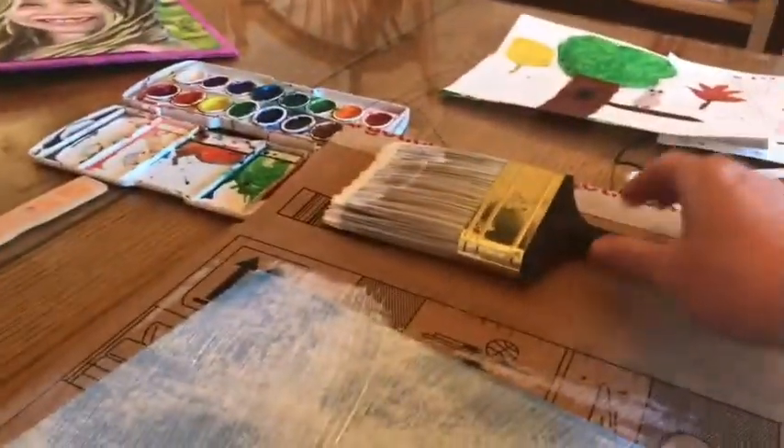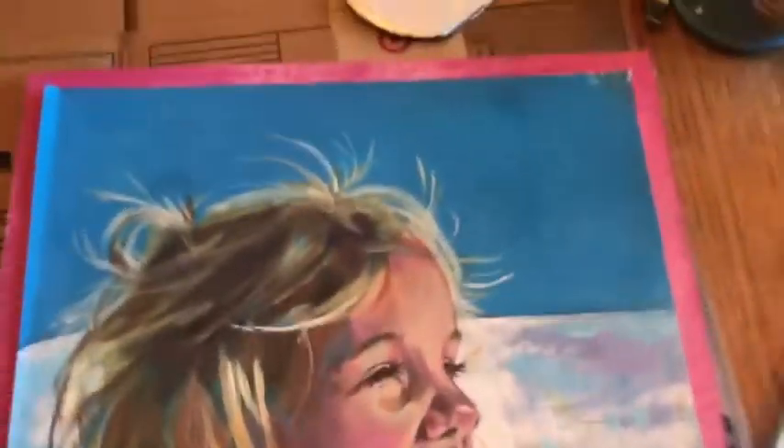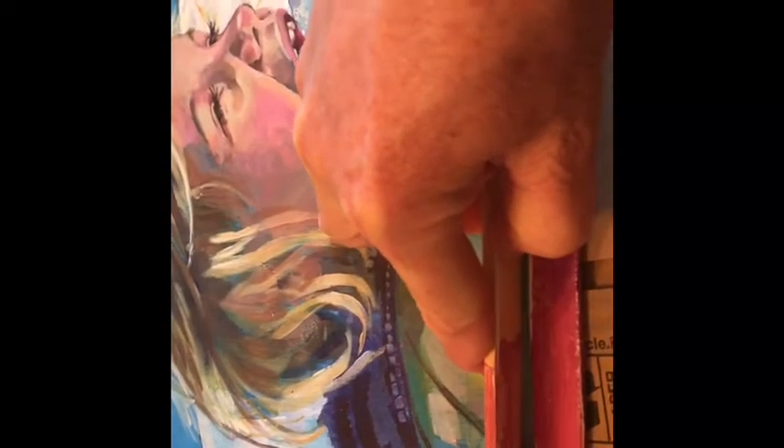This gel will dry and destroy your brushes if you don't wash them. So I'm going to make sure I put my brush somewhere where I can see it and remember to wash it right away. Okay, I'm going to try to do this one-handed — not ideal. Lifting up my poly tab now and I'm going to carefully set it on top of the wood so it doesn't land on my laptop. Now I'm going to center it on the wood so that it's even. The last thing I'm going to do is find some sort of a scraper. I found this paint stick in the basement and I'm going to start to pull from the inside out towards the edge of the poly tab and I should get a little bit of gel squirting out.